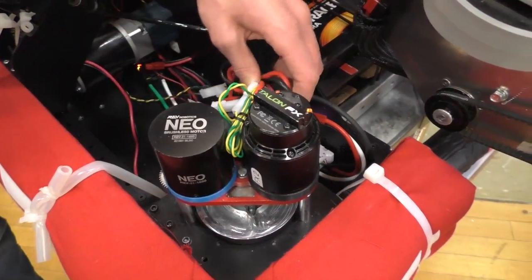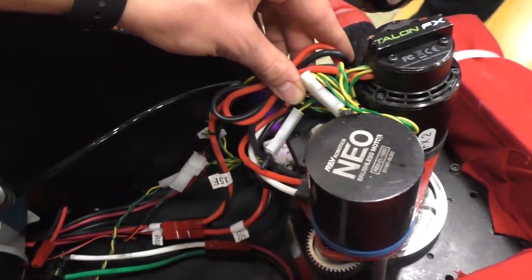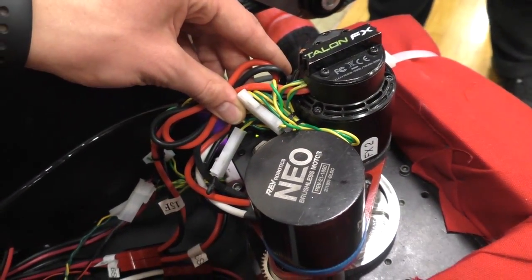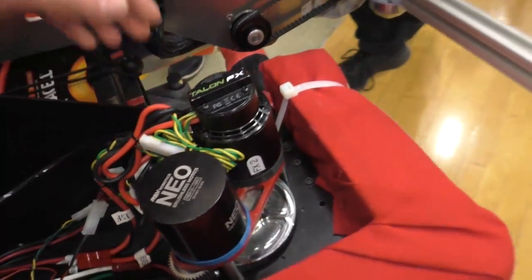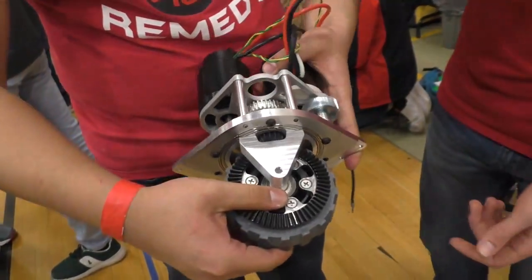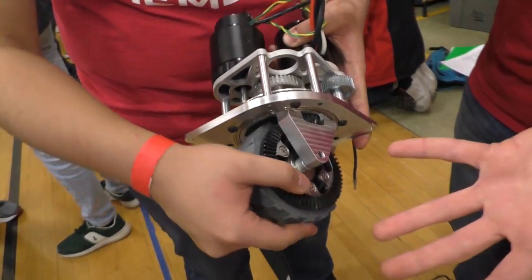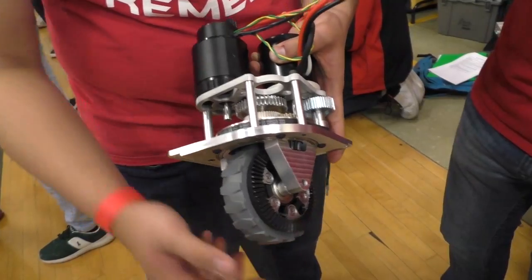We've actually modified it so that we've got the CTRE hex encoder housing on the back, as opposed to what's on the stock Swerve Drive Specialties module. That actually allows us to reduce the part count significantly by just having one shaft and gear part that goes down rather than a complicated assembly. The shaft isn't shown in this particular module, but in most of its aspects, it is a fairly stock SDS Mark II module.